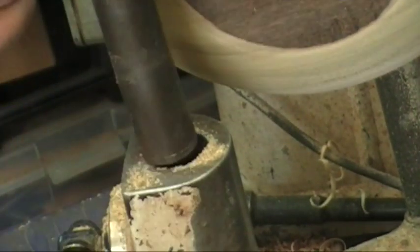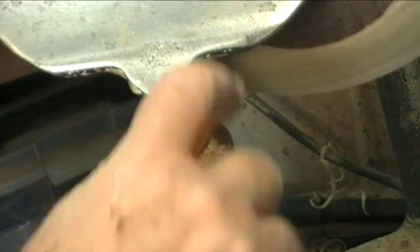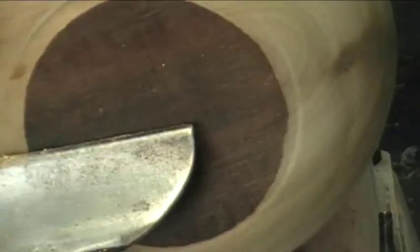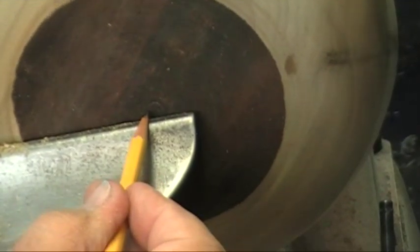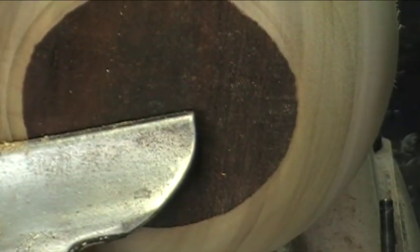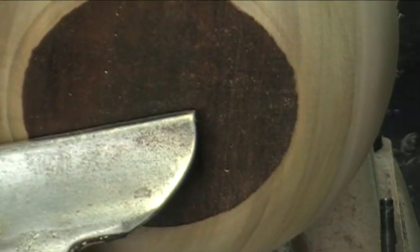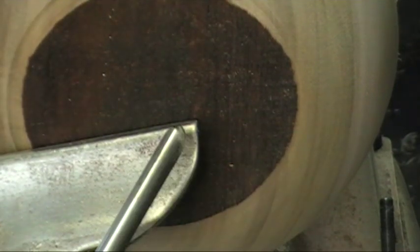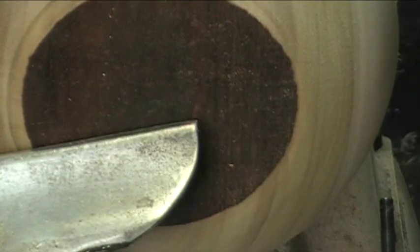That mark, when matched up with that, means that is the exact dead center of my piece, right there. So my cutter, my tool, will cross if it's this height, right at dead center, okay? Now, I don't want that, but I do know that half that distance would put the tip of my blade right there when I come in. See it? Always a good reference.